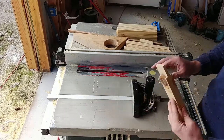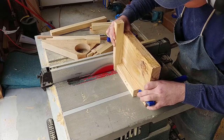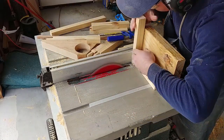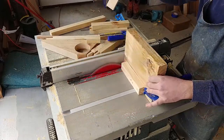The mating piece was a little bit more tricky. I had to make a special jig that kept my workpiece pressed up against the fence and also kept it from falling backwards while I ran it upright over the blade. I ran it through the blade and then flipped it over to get the exact same cut on the opposite side, and then used a chisel to clear out the waste in the middle.